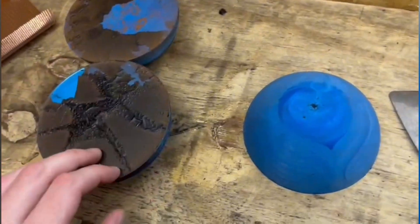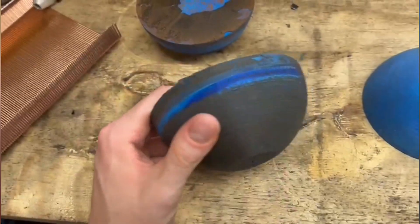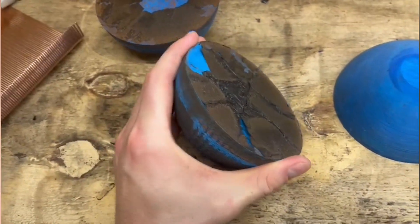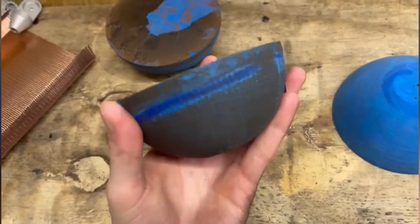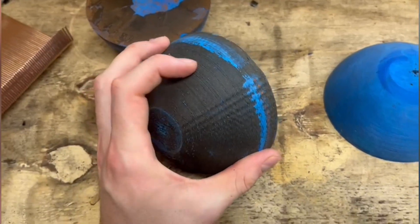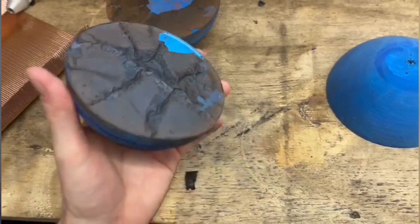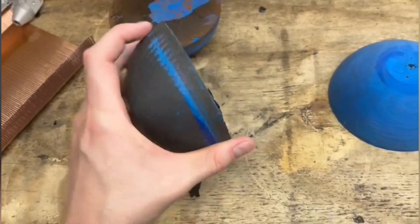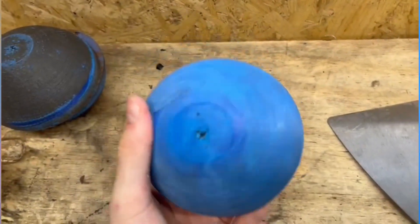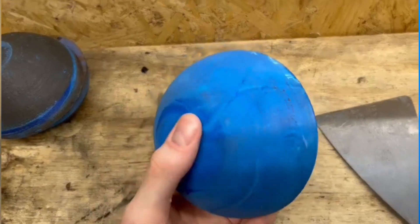To improve the overall quality of the planting bowls, the molds have been quite crusty with a lot of powder built up. I don't think they've ever been cleaned since being made. What happens is all this stuff on top sticks to the inside of the bowl, making the bowl dirty and losing that clean silvery finish. I've given it a hot soapy water scrub so it should come out nice on the inside of the bowls each time, as long as they're cleaned after each use.